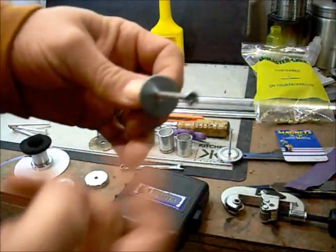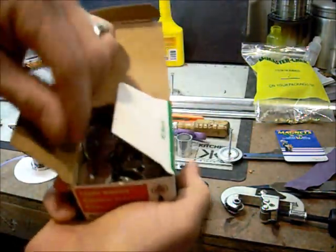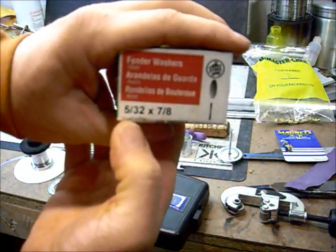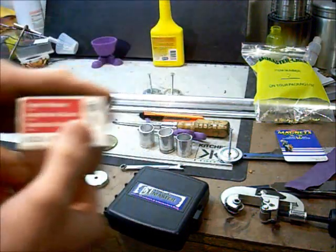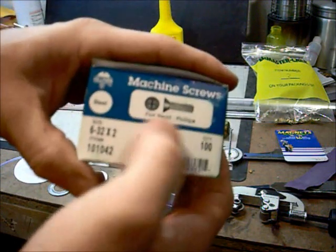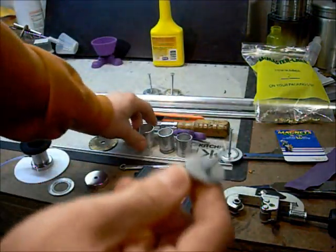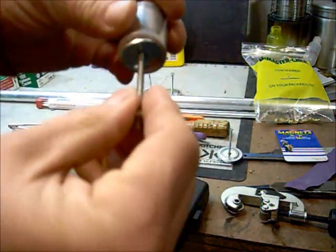The last thing is this washer, and this is the tricky part — you've got to get exactly the right washer. The key feature is the small hole in the center. It is a 5/32" by 7/8" washer, part number 290002. The washer has to be small enough so the bolt head can't go through, but large enough so when you put it inside the tube it doesn't slide right out.